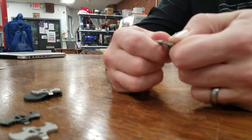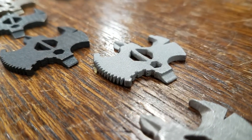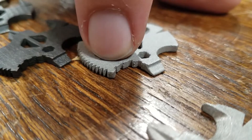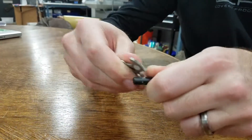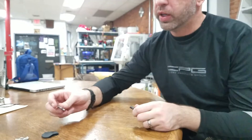You can't break it by hand, but some of the things like the small cutting edge or the saw just wouldn't be strong enough. Key tools on this are the toothed or serrated scoop and this other scoop, which is a fire starter — used with a fire starter rod. If you have a material that's not hard enough, it's not going to shoot sparks. So that kind of cut out 3D printing as a potential production process.